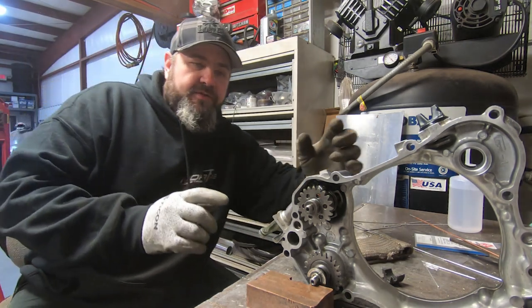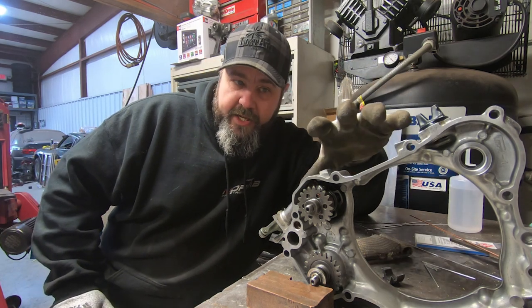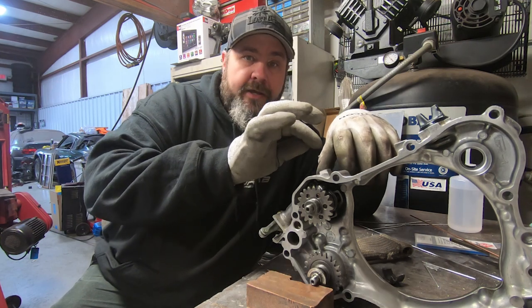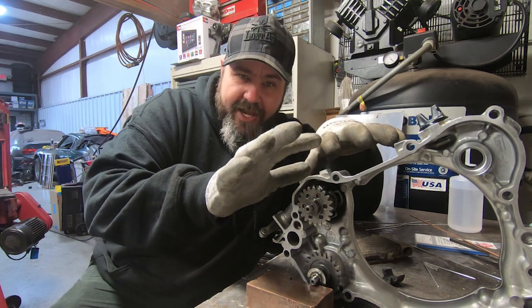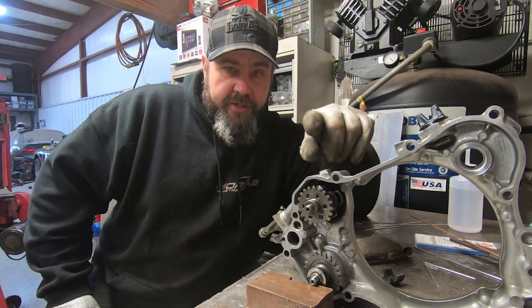So now we've got this down to a level where we can now build back on top of it. And that's exactly what we're going to do. We're literally going to take the machine and we're just going to place a bunch of wire in here and get it all set up and just literally filler rod up until we build it high enough to where I feel it's good. And what we're going to do first, though, is we're going to clean this up